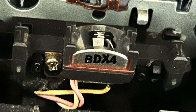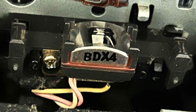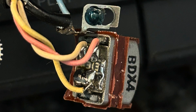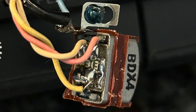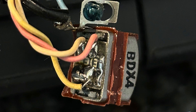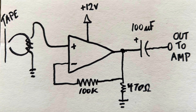Last time, I took this tape head — a magnetic tape head — out of an old cassette player and removed the wiring. The wiring includes a single ground wire at the lower part of the picture and two wires for the upper part, because it's a stereo tape head. I then connected the two upper wires together to make it a mono tape head and put it through a basic op-amp pre-amplifier circuit, as can be seen here.